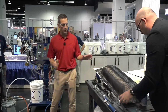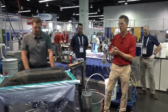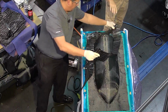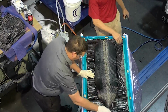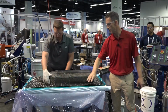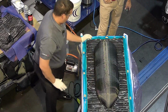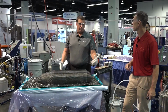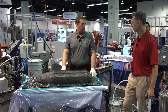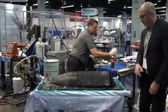And now I'm going to take us over to the next section of our demo here. We're only going to do one structural ply layup today, just for demonstration purposes. Now this will get us, what thickness, Mike, will this single ply? Each layer of this 9400 material is approximately 100 thousandths of an inch, or 2.5 millimeters. Start laying up the first layer here.